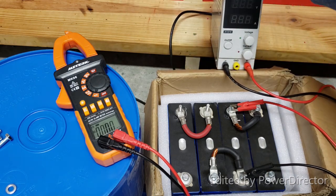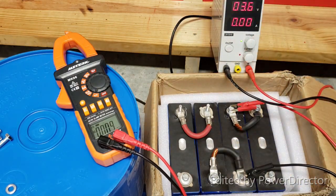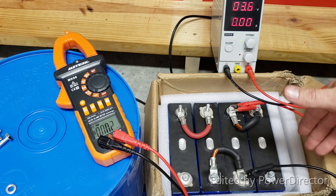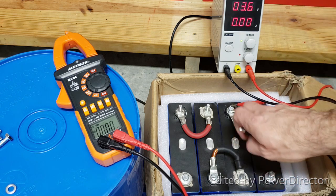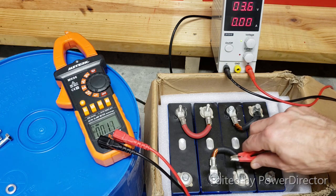There's no reason to molest it anymore, right? But if you keep it in the series and then you try to charge the series, you're just going to damage it unless you have a BMS that can stop you. That's why the BMS is very important, and everybody should have one on their batteries. I don't care what kind of battery you have, you should have some kind of battery management system on there, especially when we're dealing with such high energy capacities as we do.